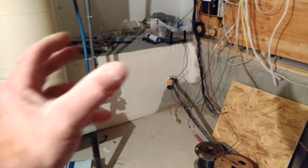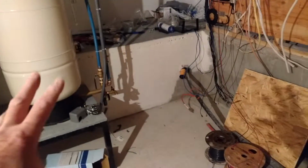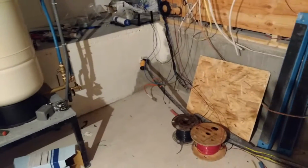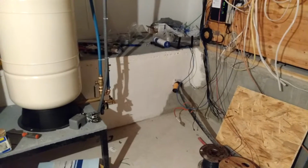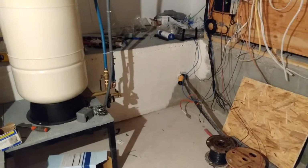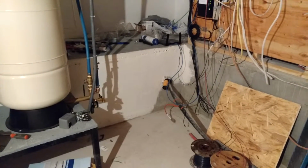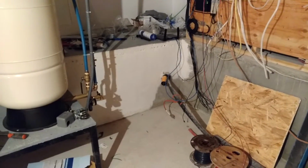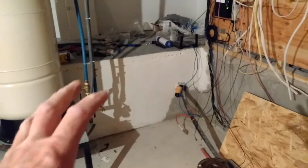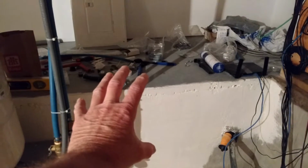But at the same time, there's energy usage, the gallons per minute, and how fast the system recovers. That's the other thing. So I found a submersible. There's two styles, a 2-wire and a 3-wire. With a 2-wire, you need your power wires down to the pump, and all the controls and everything are in the well, in the actual pump housing. And then there's a 3-wire system where literally you have a control box that sits up here, and all the control work is done up here.